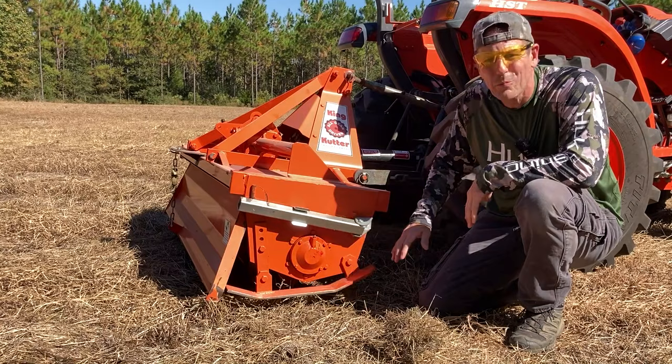I've only had this a couple of years. The price point was $1,750 two or three years ago, and they're probably well over $2,000 now — so not a cheap piece of equipment. My tines don't have a lot of wear. The leading edge hits the soil first and will wear in a triangle shape, but every one of them is replaceable. It's not an easy job to replace them, but it can be done. I've got 10 or 12 acres on this tiller and you can see the paint is worn back and the leading edge is worn a little, but they've still got a lot of life left.